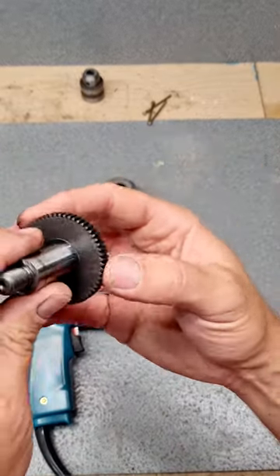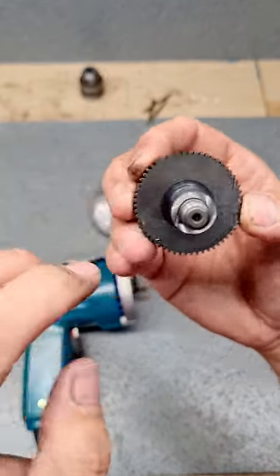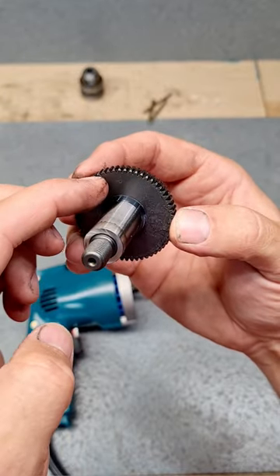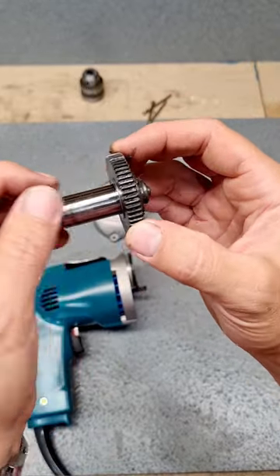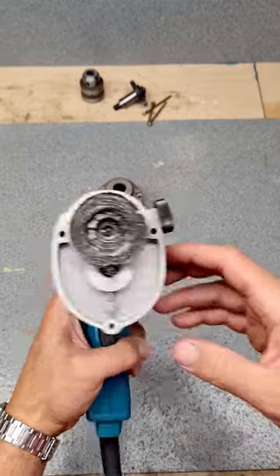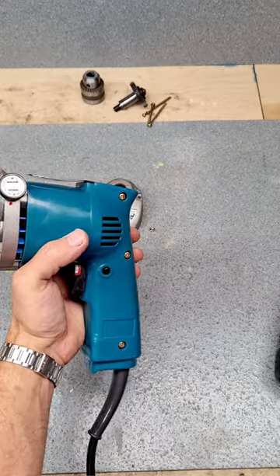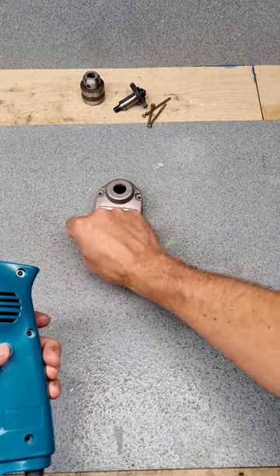The actual spindle and gear - no powder metallurgy on it. Look at that gear, you can see the turn marks - it's been cut from one solid piece. That gear's been machined, hobbed as well, all the teeth hobbed out of it, hardened, and that shaft pressed on. Nut and bolt construction - three screws, three nuts hold them together.